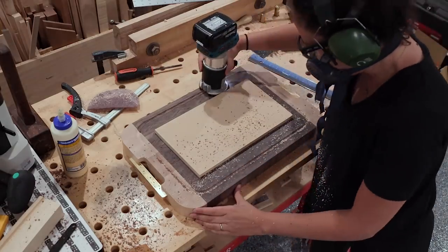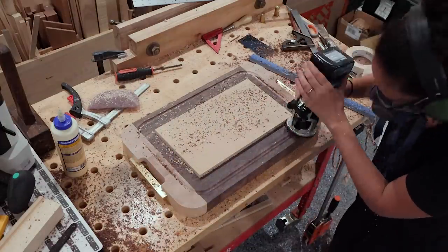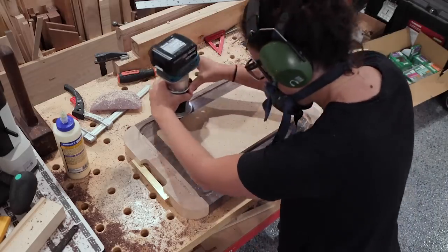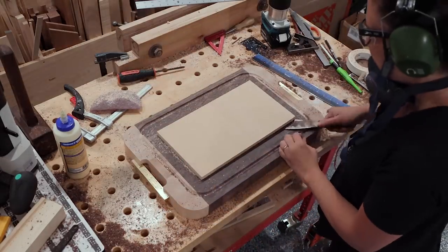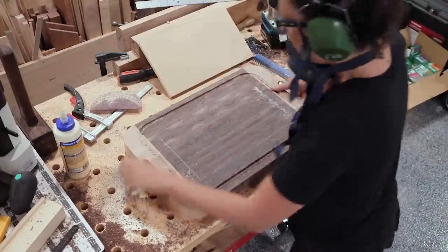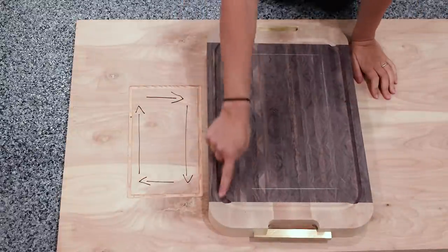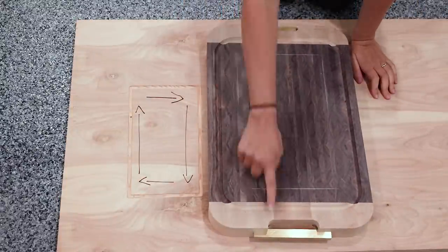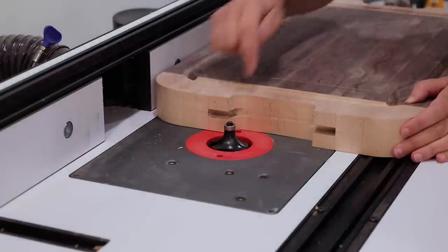With minimal effort I can move the router along the template and create a perfect juice groove. I take multiple passes to get to the final depth, then one last tiny pass to clean up any burn marks. You can clearly see the difference in the corners between using an inside or outside template — the roundness just works so much better here.